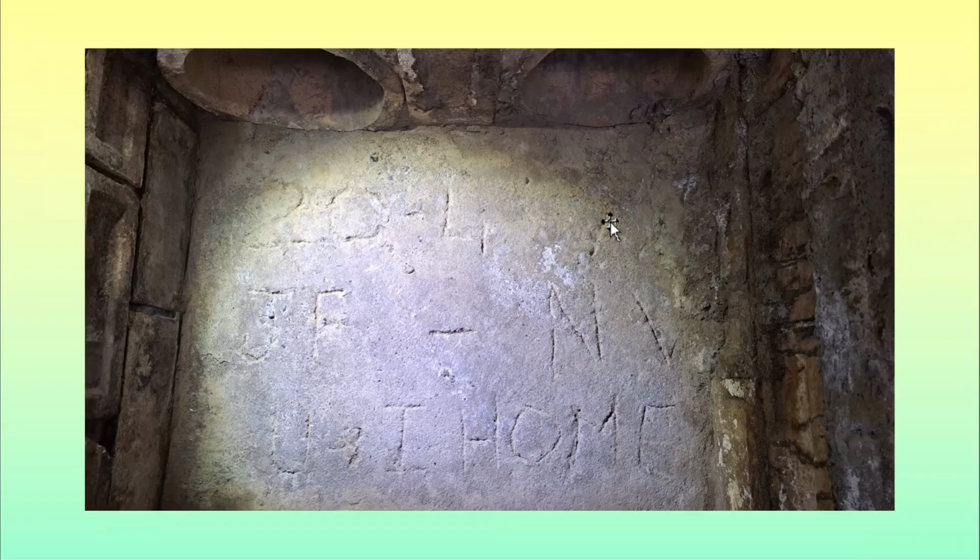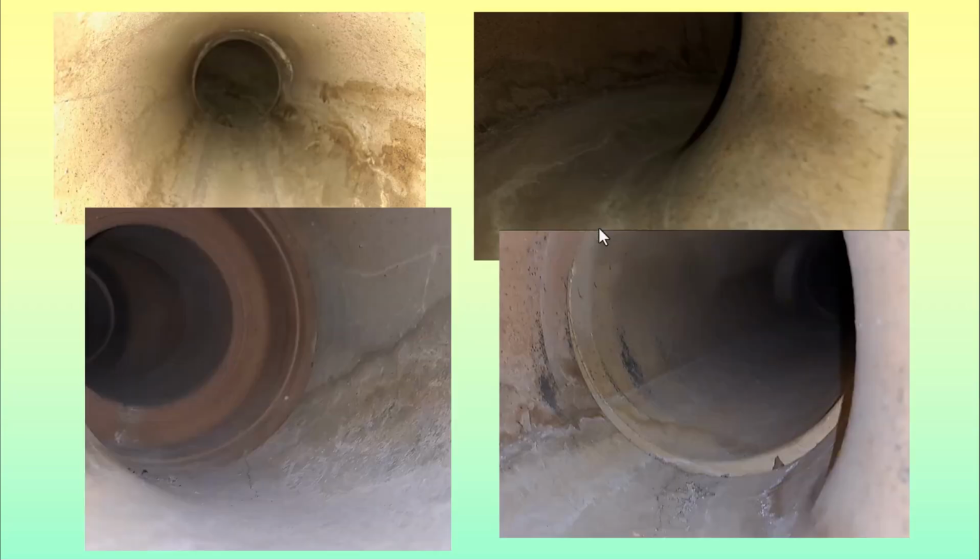We had a little bit of information left by the builders from 1977. When you look at the ducts inside, you can see that they're ceramic and really quite nice and smooth on the edges. When we look around this corner, you can just see an outlet to the left there. That's a 150 millimeter diameter outlet, and all the vents have 150 millimeters going to them. On the left hand side, the 220 millimeter steps down to 150 quite quickly, and you can see an outlet to the right, which is just opposite the air intake grill that we'll put in. This further continues up to the other end of the house with 4 vents up there.